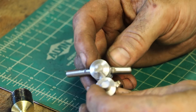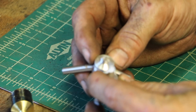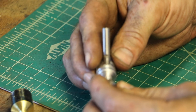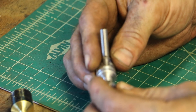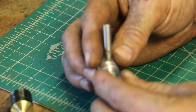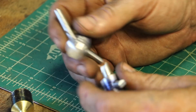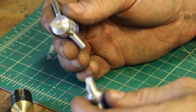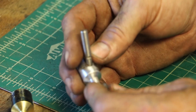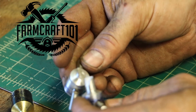There's what a good cast material does versus aluminum foil cast without any care. Pretty big difference — they both look about the same on the outside, but not so much inside. So cool, I'm glad I did that. This is going to help me take my metalworking to the next level. I can pour little test ingots when I do a melt and check how strong it is. I can do some tests and see if degassing helps the tensile strength, if flux helps the tensile strength, adding additives. This probably has silicon in it. This stuff's all been worked out, but it's not readily available for do-it-yourselfers. I've looked, and you find bits and pieces here and there. But it's fun to figure it out yourself and do some tests.